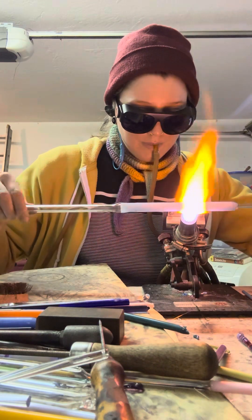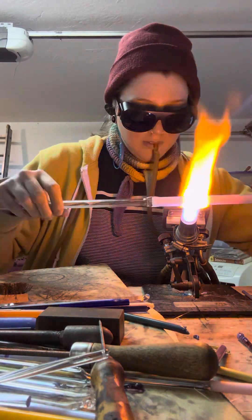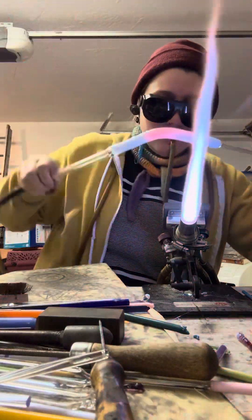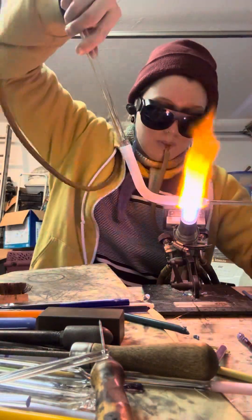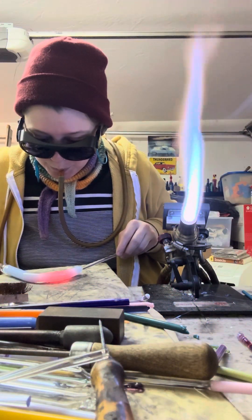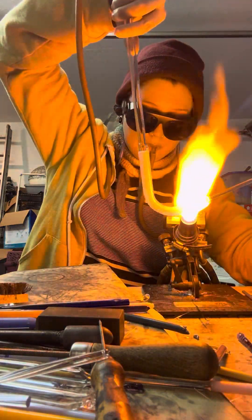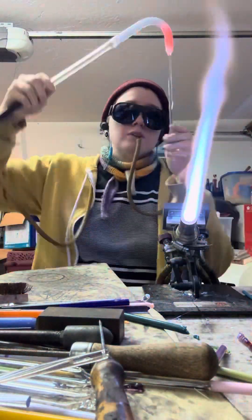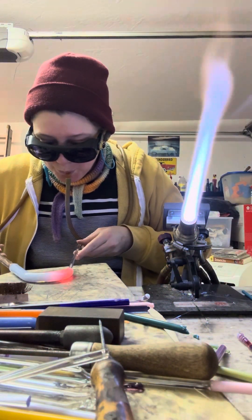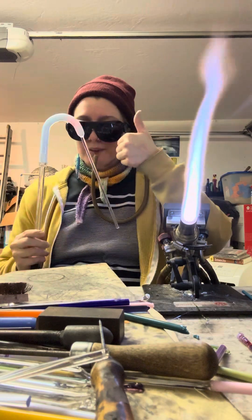Here what I'm doing is heating across a large section of the middle portion of the tubing, sinking the heat into the wall weight, bringing it down to my kiln shelf, and then making my very first bend. When I am bending I'm also holding pressure in my tube — not blowing really hard, just holding the pressure steady with my breath. I don't want the walls to collapse, so I'm giving a little bit of pressure but not so much as to blow it out. I'm just holding the walls steady.